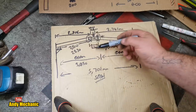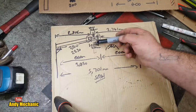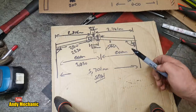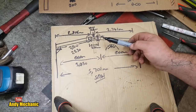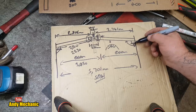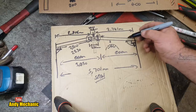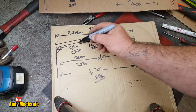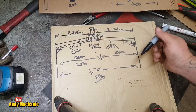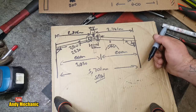This beam will go in first, supported with some timber or a jack from the concrete wall, get that into place, bolt it all up, then put the second beam in place and bolt that up. At the ends I've made it a horizontal joint — I've done that deliberately so I can apply shims there to raise the whole beam up so it's supporting the roof, because the beam may well sag a little bit, and I can compensate for the sag with those shims. That's the plan.